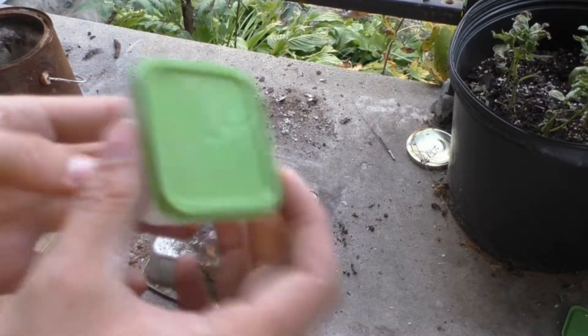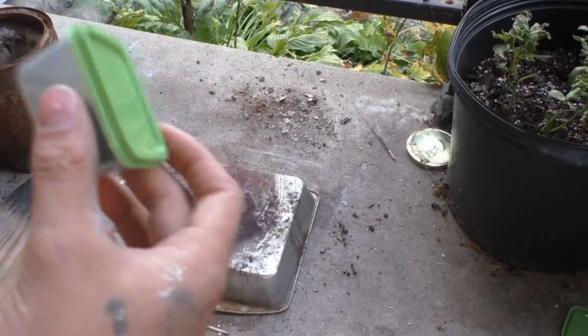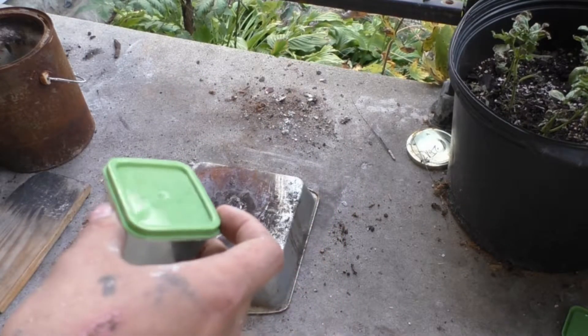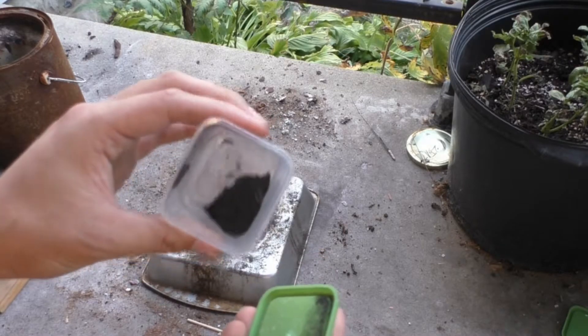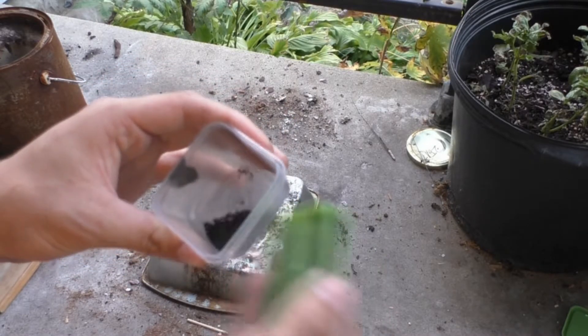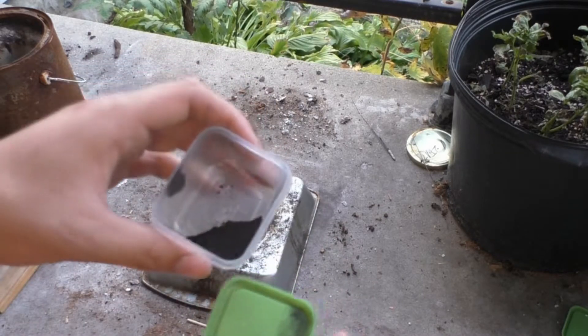Basically, this is dark magnesium powder I had milled using my milling technique — the same one I used to make dark aluminum powder, and I have a video on that in the description below if you're interested. This is magnesium that was ground down in a ball mill along with a little bit of charcoal powder to help prevent it from oxidizing, so it keeps it more reactive.